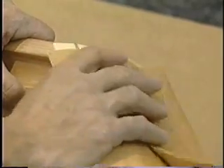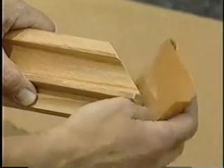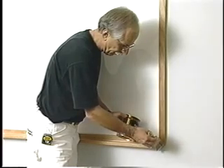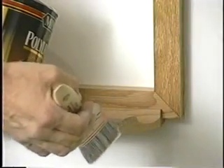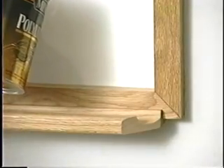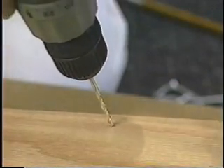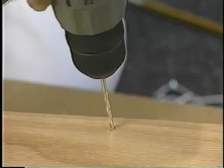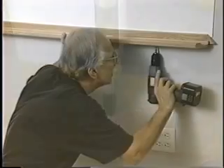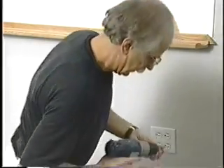The vertical and top pieces of trim can now be installed with construction adhesive, which will allow for slight adjustment of pieces for a proper fit. Finish nails may be used to hold the trim in place as the adhesive cures. Most installations require a full-length tray across the entire length of the wall covering. Outside edges of the tray can be left as a blunt end or mitered to a 45-degree angle. The ends should then be finished with a similar stain and clear coated with a satin urethane finish. Install the tray with number 10 by 1 inch wood screws. Pre-drill 1/8 inch holes and use the countersink bit to create small cavities to hide the screw heads. Install wood screws every 16 inches on center, slightly offset from the trim installation hardware.